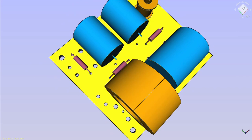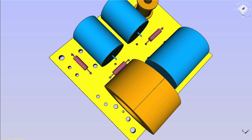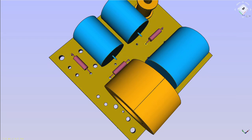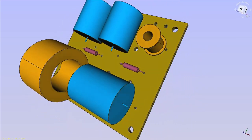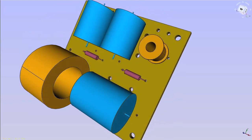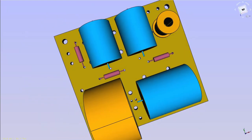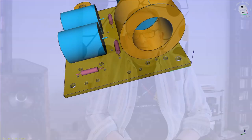It doesn't look as neat, but it works well. I suggest you drill small holes to push the component leads through to the back of the board — that way the top is neater and the wiring is hidden underneath. It's important the circuit stays electrically the same as the original to achieve the frequency response the crossover was designed to, which suits the drive units and the cabinet. Experts could make changes here based on actual measurements to fine-tune the response further, but that's beyond the scope of this video.